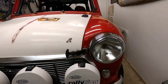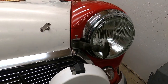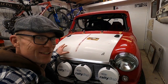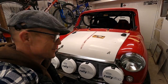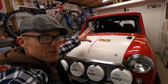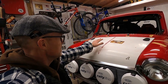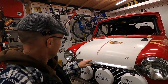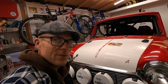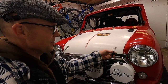So I'm going for something slightly different. I've decided to ditch it all and go for the big rubber hook idea - it's much less hassle and means it'll be out of the way. Nobody needs to know the sequence for fitting the bonnet, which is a stupid idea. Because with these springs and those clips there was a sequence you had to follow: pop the clips open, pop these open, lift up the back quite high and slide it so that this chrome trim went underneath the springs, and the same thing putting the bonnet back on. No - this is a rally car, we can't be doing with that. So I'm going to take those off and fit just rubber hooks on the front.